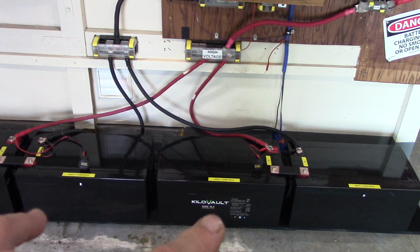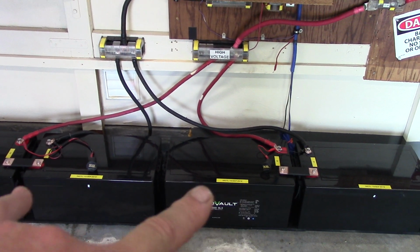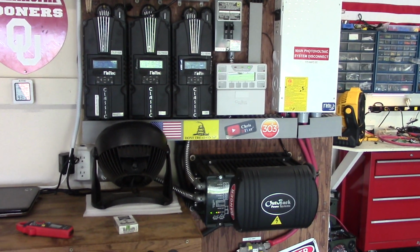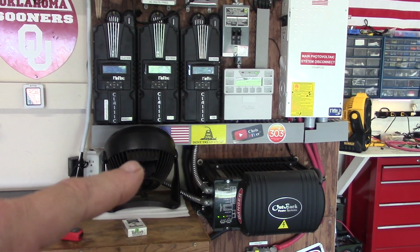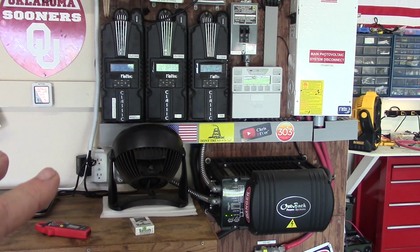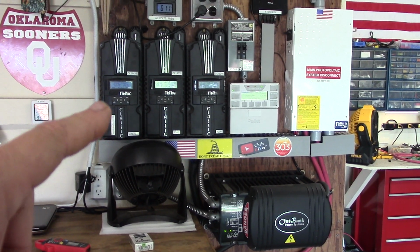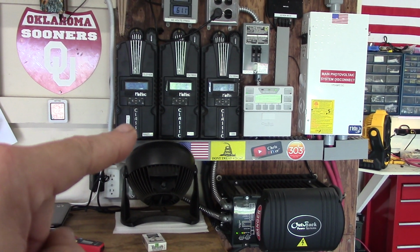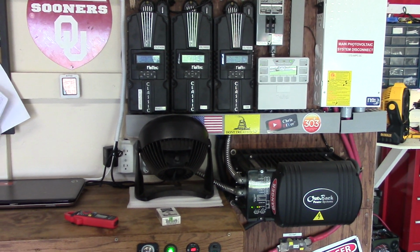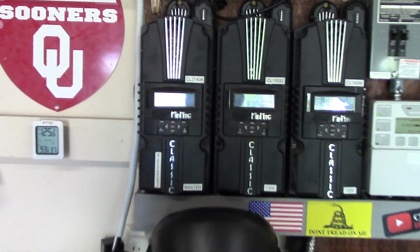I didn't have the inverter on, or was inverting, but these things shot up really high, and I was like, what? Whoa, whoa. So I just slammed the breakers down, wondering what the hell is going on. So I tried the other two, and they all did the same thing. So I said, okay, I'm smarter than this. So what I had to do was do factory resets on all 3 of these guys, and now everything's stable. It came right up. I reset everything for, here, I'll show you.